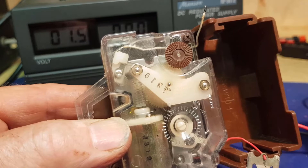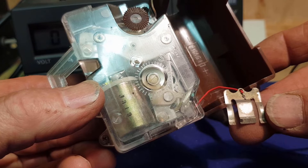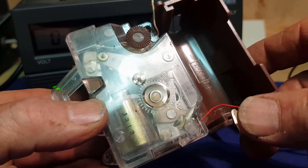As long as we can manufacture a plate for the negative end for the battery, I'll take this to work and see if I can find some spring steel and cut out something. It doesn't have to be quite as ornate as the original - as long as it's the same width it'll fit in the slot. We'll try and get the middle part bent a little bit so it puts a bit of pressure on the battery.